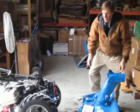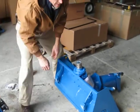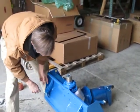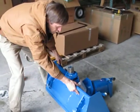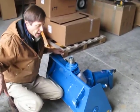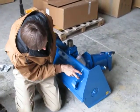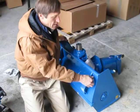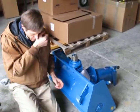There are also skids on the bottom. So you've got skids where the snowblower can slide along the ground. These skids can be adjusted by loosening these two bolts on either side and then sliding the skid into the position you want. They've got a channel with a lip rolled over on the bottom, so you actually don't need to have both bolts in here. If you're using this blower on a tractor with really tall wheels and you need the skid to come out further than what the two bolts will allow — they would run out of adjustment in the slot — you can take out one bolt and continue sliding the skid out. Even just the one bolt will hold it in position because of the way this skid is tucked into the bottom of the angle iron, so it can't swivel. One bolt's sufficient.